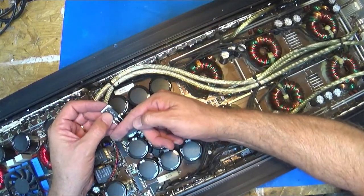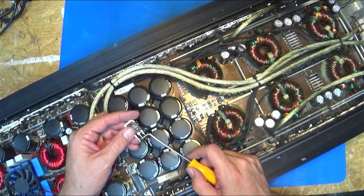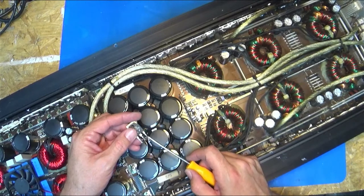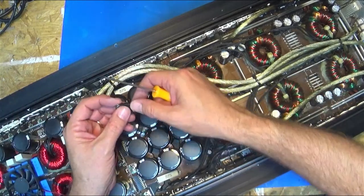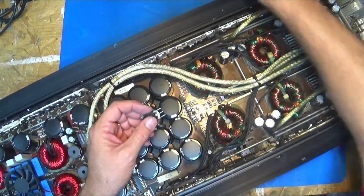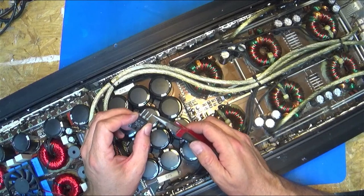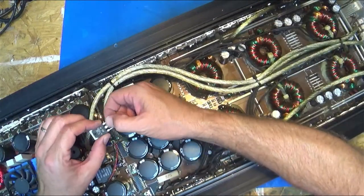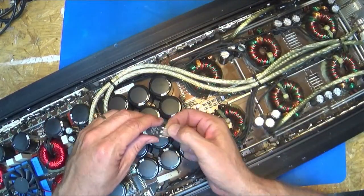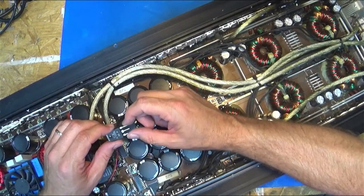So when they're down in the board, they go through the board, and so part of the leg is sticking out. The vibration damage will break the solder out from around these, and they can lose their contact, but can also break these legs. So what you have to do when you get vibration damage is desolder every one of them. Get them out like this, nice and clean. Get your eye loupe and inspect all those legs, and even use a little pair of pliers to make sure that there's not a stress spot in them. Because when I took some of them out, they came out like this with one long leg and two legs that were broke off in the board still. And the vibration damage just got them.